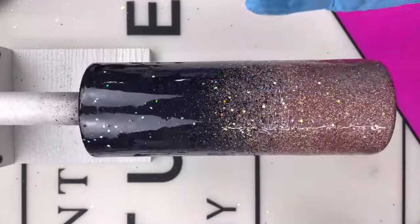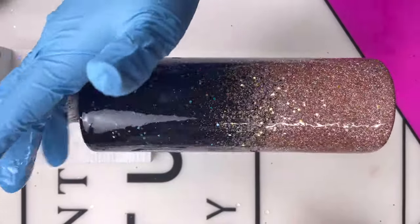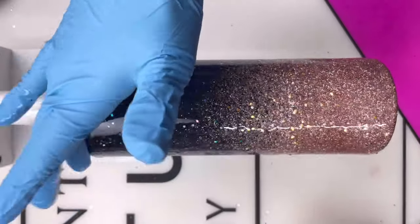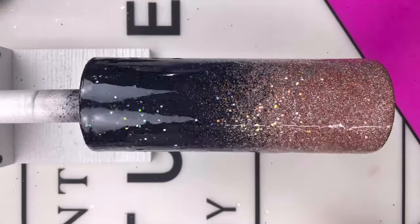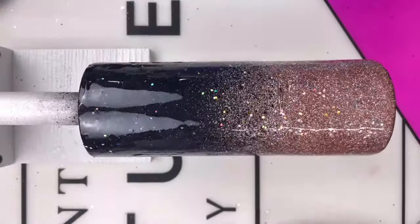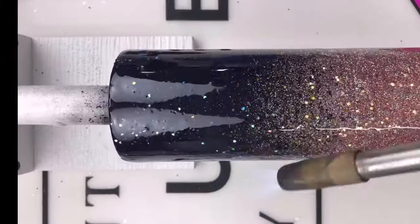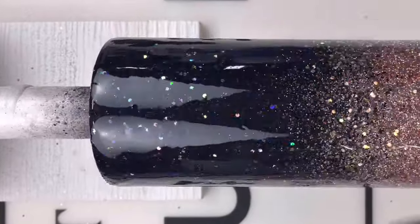Something else I don't want you to forget is your top and bottom edges. We already got the bottom, but give the top edge a couple of taps as it turns to make sure you've got epoxy all the way up to that top edge. Once we are sanding, we'll go ahead and clean that epoxy edge up — but for right now just make sure it is fully epoxied. Next up we're going to take our torch and pop all those little micro bubbles. You can see them popping in the video and that is going to help us have a beautiful coat.